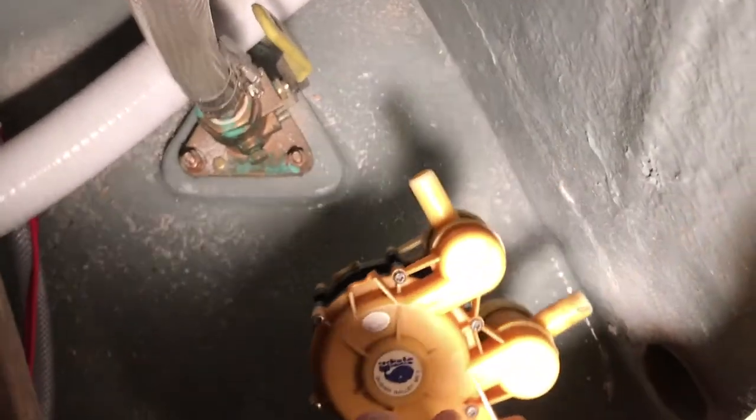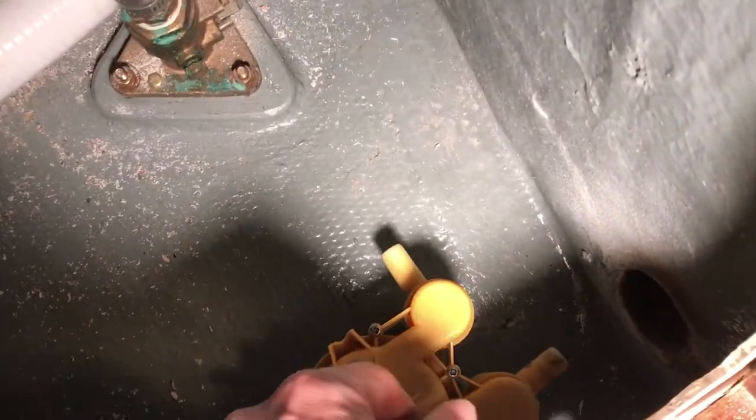In trying to put the hose on the pump — because I've been trying to get the pump as close to the bulkhead as possible — I had trouble with the hose clamp. What I ended up doing was just using a hole saw, putting a really big hole in there so that the hose clamp is not a problem. I'm going to seal it back up from the wet locker side.